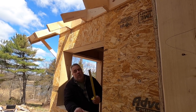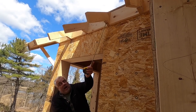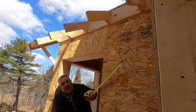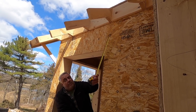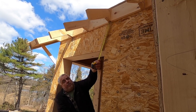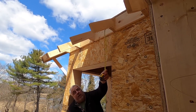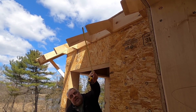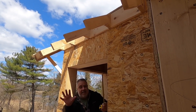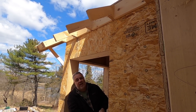A couple things to notice here. Notice the extension of that seat cut, how it comes out. That's because we have rigid insulation, a drainage plane, a rain screen, and a bunch of things happening out here that are going to build out the wall. So we had to plan for all that displacement of the rafter tail. The rafter tail is then sized so that the fascia here is the designated, intentional size as an architect that I look for aesthetically.